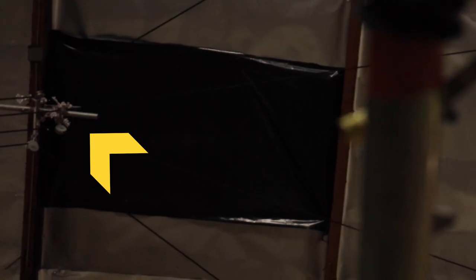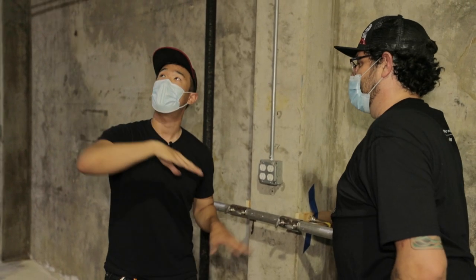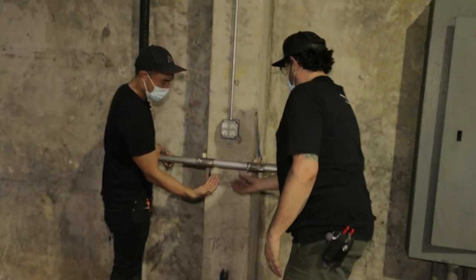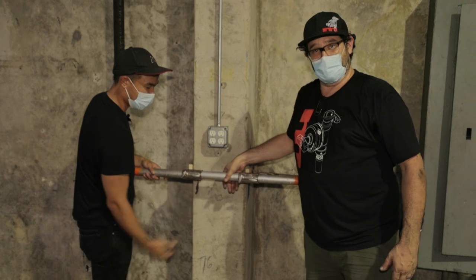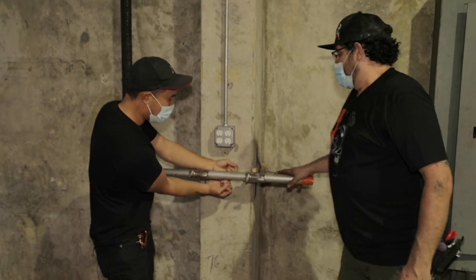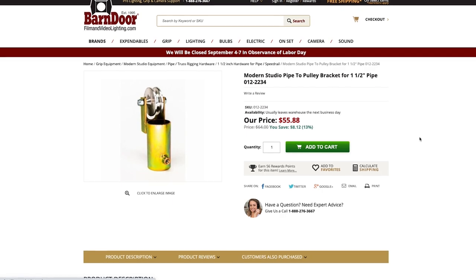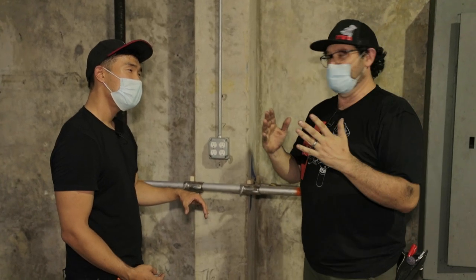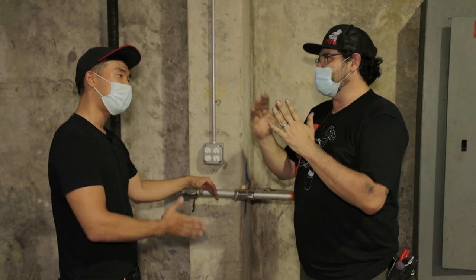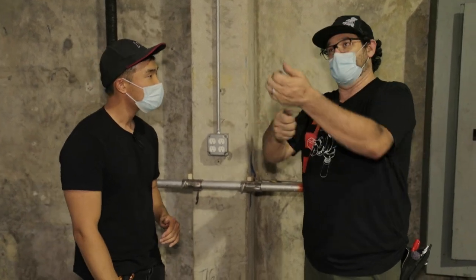The fifth one comes in between where the pulleys are actually going to tie to. We have all the ropes and knots within it — if you tied it at the end it could easily slide right off, but here it's in the captured point. The pulley is basically ropes here and then the pulley hangs from here, and this is where the main rope goes — which gives it the ability to move a little bit. It's not hard mounted. You want to give it a little bit of ability to shift so that nothing is too rigid and it's not going to fight you.